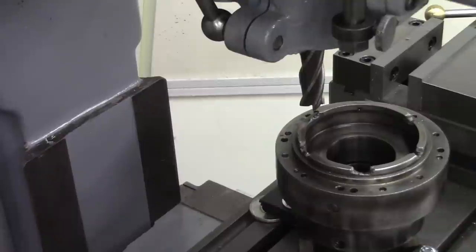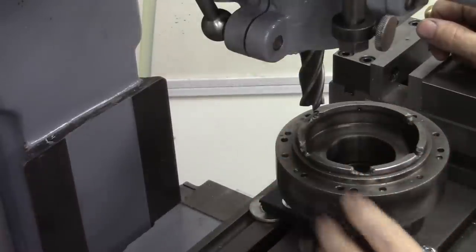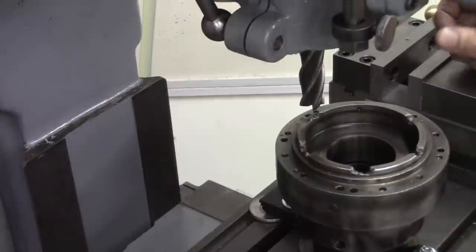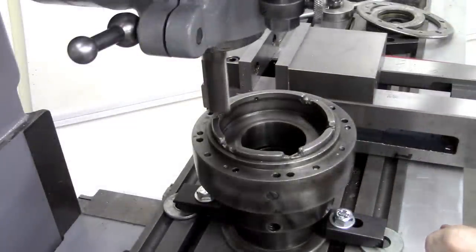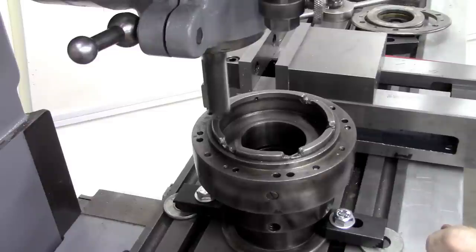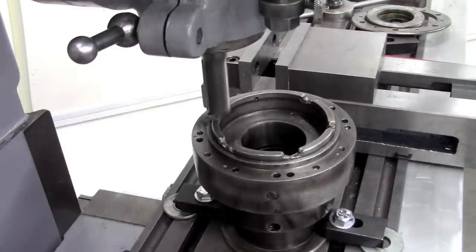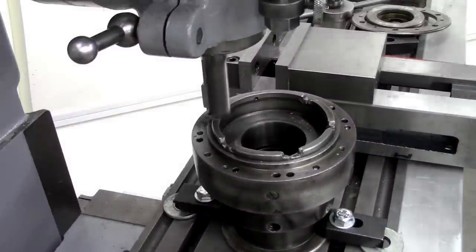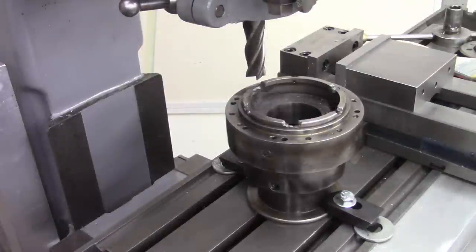A little bit nervous about this. Hopefully I've got it clamped down adequately. The end mill I'm using is slightly dull. I haven't got a sharp one. It's just under 3/4 inch, which I'm hoping will catch all the damage on each one. I've already been through it one time, and it looked like some of them might leave a little bit of the damage, but I think it'll be close enough. So let's get started on that. Probably wouldn't hurt to lock the table. Well, that did all right. Let's go to hole number two.